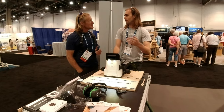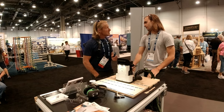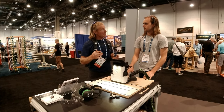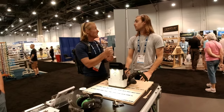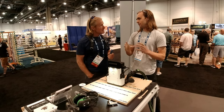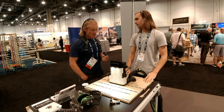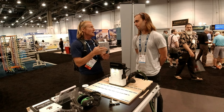One thing we see people doing is digitizing their templates. Instead of having a physical template sitting around your shop for years, you digitize it in the software. Anytime you need it, you can either make another physical template that matches all the others, or just cut it directly in the piece. You could use this as a hybrid — use it to make your templates exactly right, since templates take a really long time, and once you have the digital fingerprint, cutting another is easy.